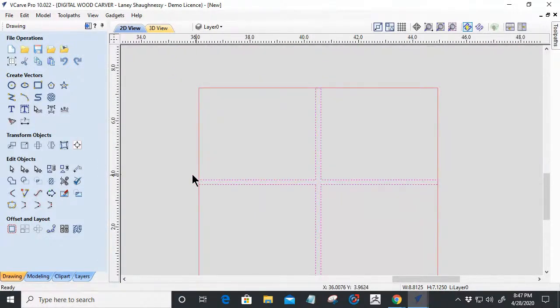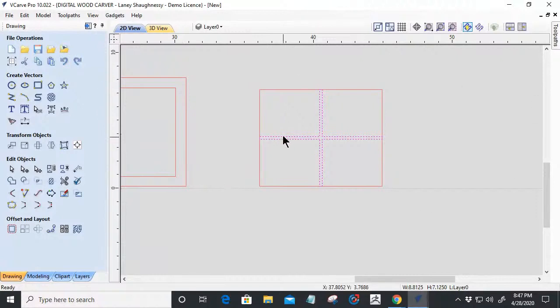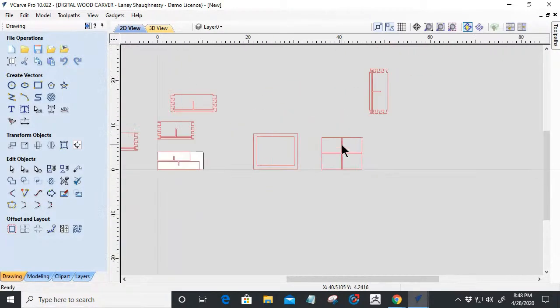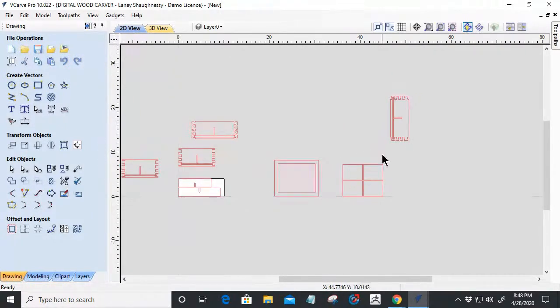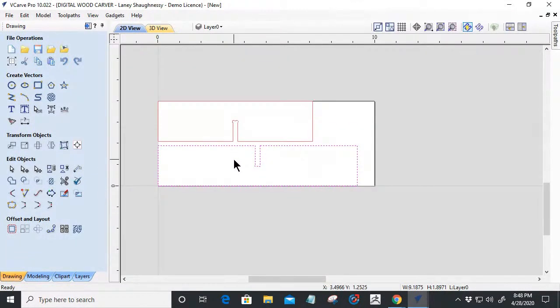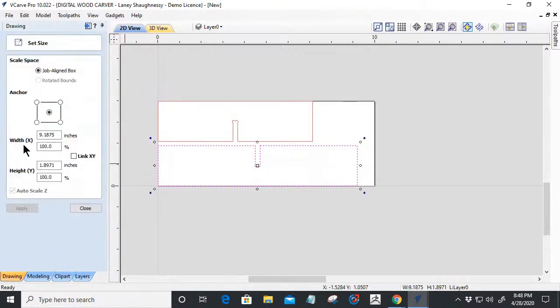All right. Now, these are going to be grooves cut a 16th of an inch deep into the base of this board here. Guess why I paused. This base is the same size as my individual slats that are fitting into the grooves. So the width of 8.8125 is all that this one needs to be. So I have it drawn too long. Good catch there.